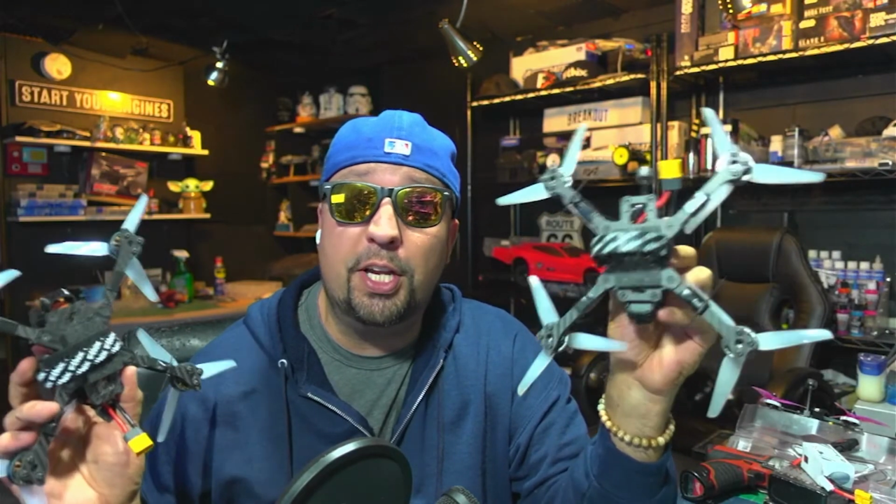So yeah, I haven't got to fly these babies as much as I would have liked to. The weather has been just atrocious and daylight savings time is coming up, so that's going to cut into flight time even more. But if you're looking for a great frame to play with over the winter, or if you're lucky enough that you could still race, it looks like they're all in on this Sharkbite stuff. I would go that route before I would go the DJI route, because I think the latency issues are where they're going to focus their attention, and it's way better having a constant latency versus the variable. DJI does have that 4x3 though, so what we really need is a Sharkbite camera in a micro size that's 4x3 and not 16x9.